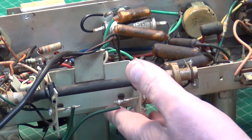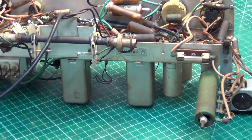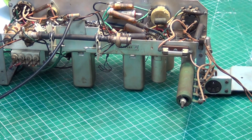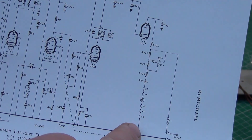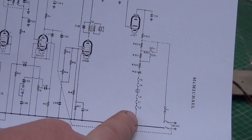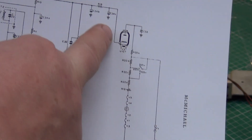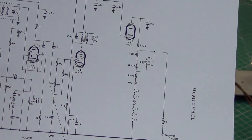I don't like things which are AC/DC like this. It's common in America, but it's not common here. You've got a mains dropper and a series heater chain, so instead of having a mains transformer, each of these valves is in series with each other, producing a 100 milliamp heater chain. Then you've got a rectifier valve, two smoothing capacitors, and off it goes to the rest of the radio.